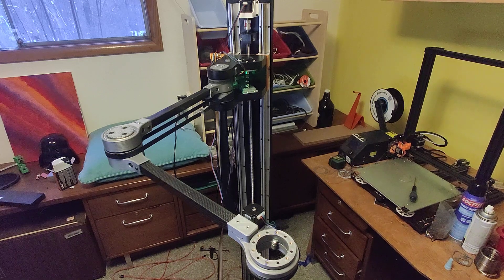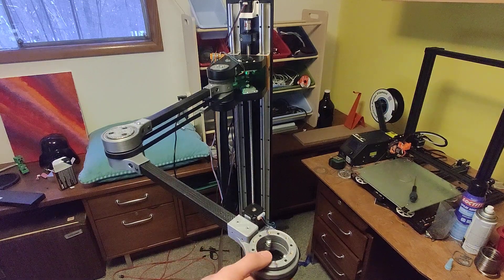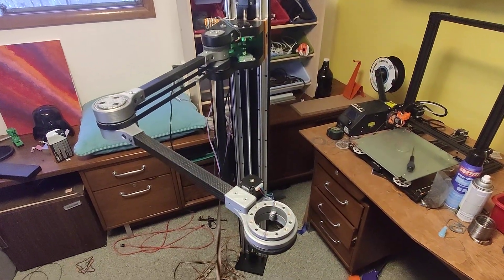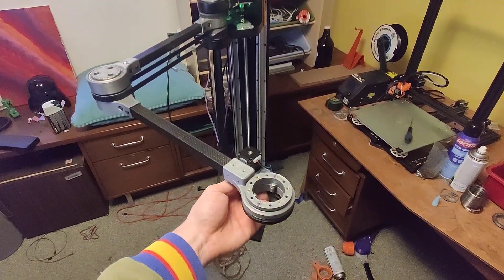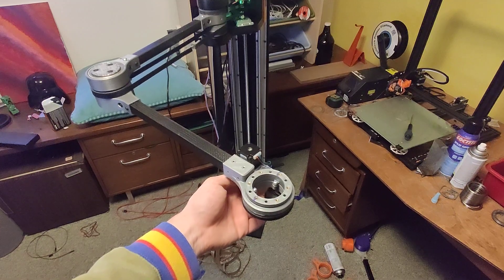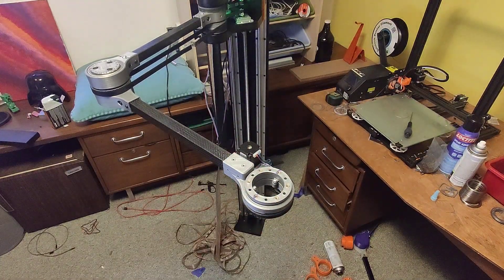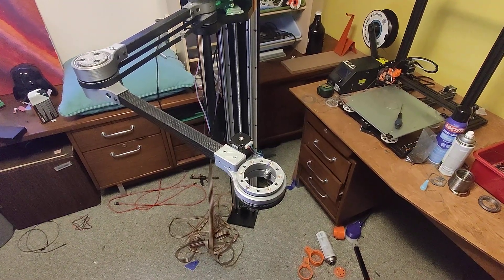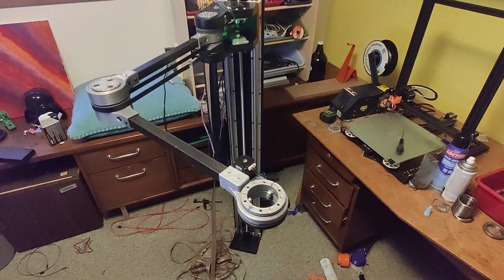This is an update video on the arm. As of now I have the wrist joint working — it's a NEMA 14 connected to a 16-tooth gear on the bottom, and then it's just a belt that goes around. On the top and bottom there are brass inserts and some extra holes that you can screw into, so you can mount an extruder and hot end, because a Bowden setup on a printer this large just wouldn't work.